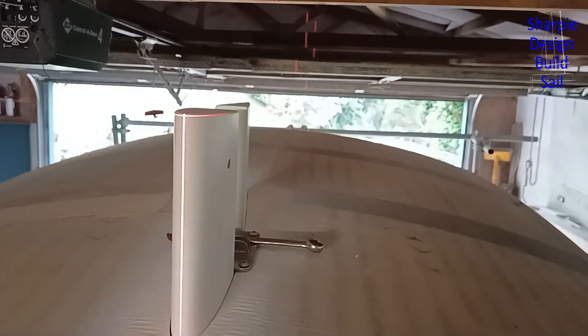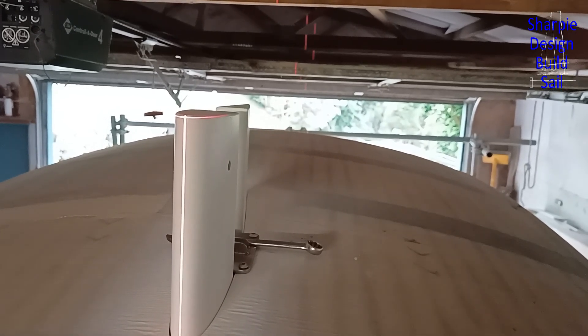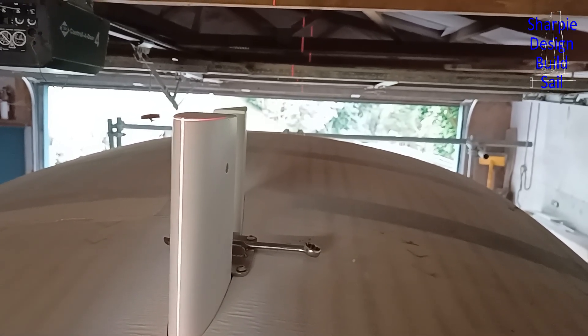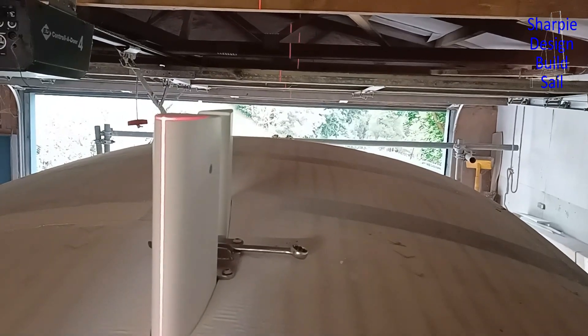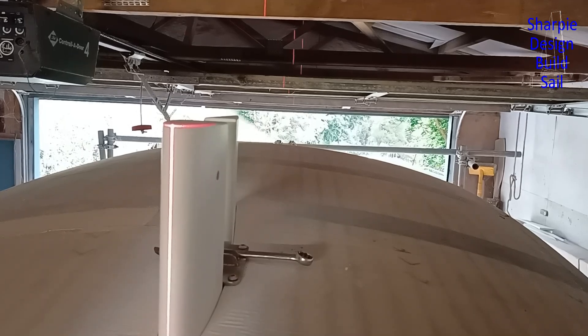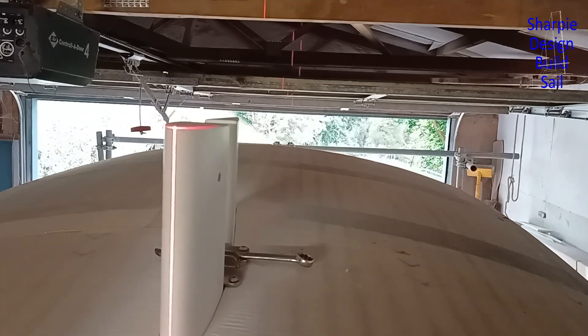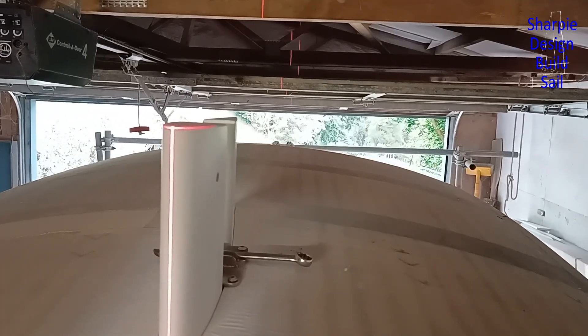There's some plywood to make it go down and connect with the trailer. Will the boat make it out of the shed sitting on the trailer? It will drop down probably another 20 to 25 millimeters, and using the laser — it's hard for you to see — it shows the door is too low by about two inches or 50 millimeters. On my previous trailer sailor, to get it in the shed I used to let the tires down, and that worked quite well.